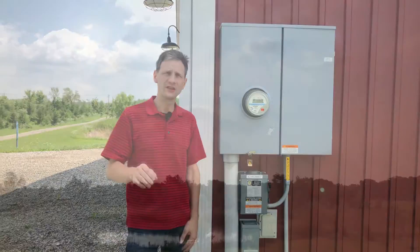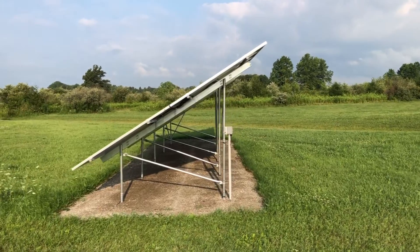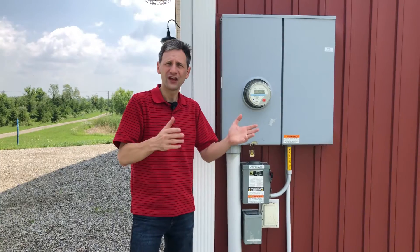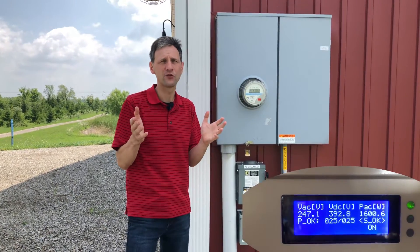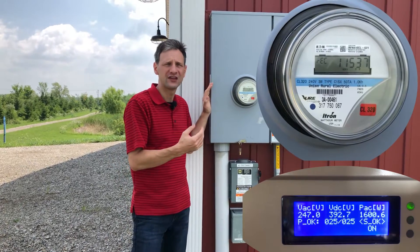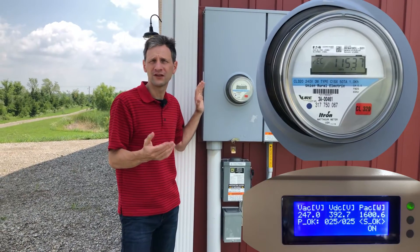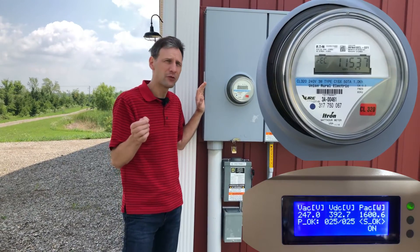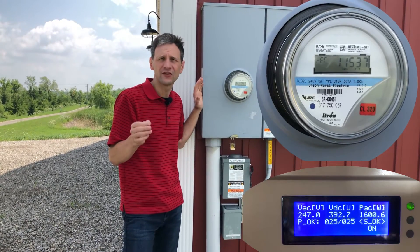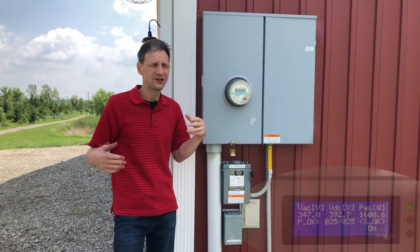You can see the sun is just coming up over the horizon. If you look at the solar panels, it's hitting the edge, and you can see from the shadow behind them that the sun is not really hitting the front of the panels yet. If we take a look at the inverter, we can see we're producing about 1,600 watts. On the meter there is a 'received' — that's power received — and a 'delivered' — that's power delivered. The numbers haven't changed because the 1,600 watts we're producing is pretty much exactly the same as what we're consuming, so nothing goes back to the grid.